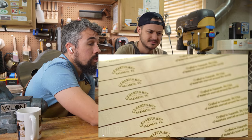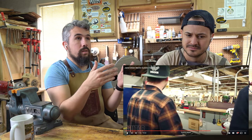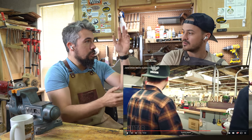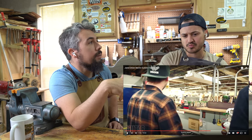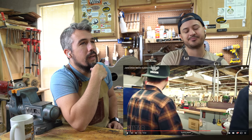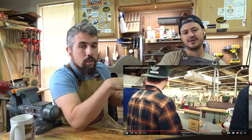If a piece of spruce isn't quite good enough for a top, we're going to use it for center strips. You look down through the sound holes and you see CF Martin & Company, Nazareth PA. We use robotics, lasers, CNC machinery, but when it comes to gluing in the ribbon, we haven't found anything better than clothespins. What they do on your back strip is the grain runs perpendicular to the normal way — they take all those defect tops, flip them on their side, and do that. I started doing that years ago — I was paying like five bucks a strip for those backstraps.